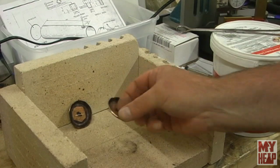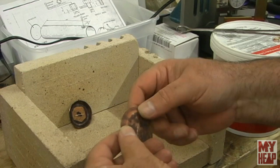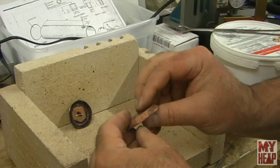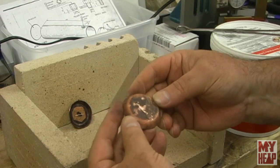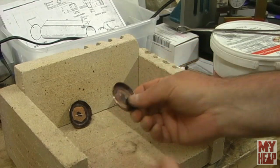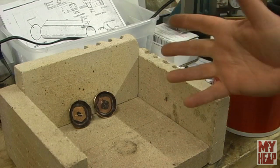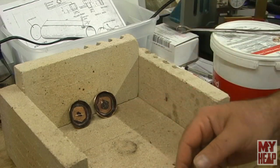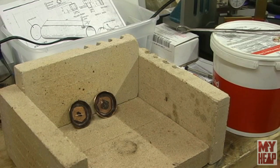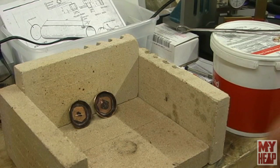The ends have been started to form. As you work copper it will work-harden and you risk cracking it, so we have to make it soft again. We do that by a process called annealing. With copper and other cuprous alloys, to anneal them you simply heat them up to red heat and then you can either let them air cool or quench them. I'm going to heat them to red heat, let them cool to black, and then quench them.